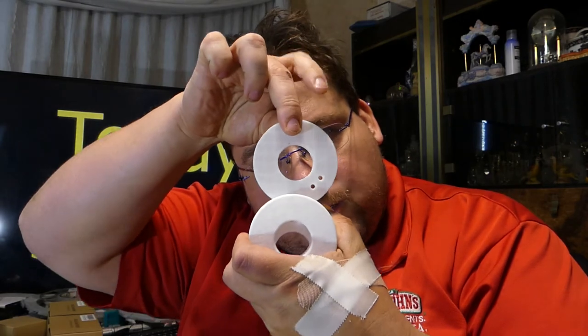So remember, when you do a vase print, there's nothing to support your next extrusion layer on top of the first layer, okay? So you have to make sure that your layer height is low enough and your multiplier is high enough to ensure that when that angle occurs, when it moves that layer over in order to get your arc, your curve, and the sharper the curve, the more it has to move each layer over in order to get it. And eventually what's going to happen is your layer is going to move out to the point where it's not quite contacting anymore. And so any deviation at all in your printer, any extrusion goof up, any wobble, any wind blowing, whatever, might be enough to cause them to, oops, they're not touching, and then your parts just warp away.